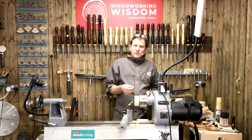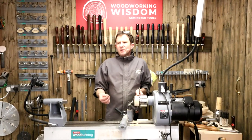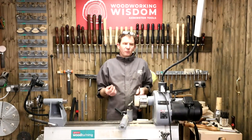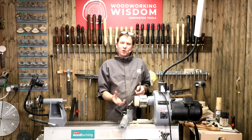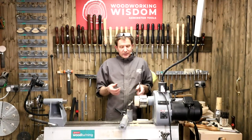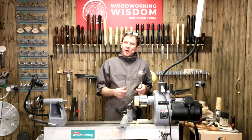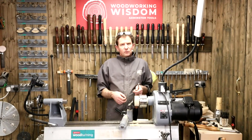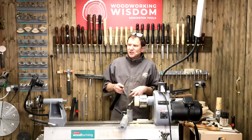Biggest consideration I would say, if you're thinking about that bit, hold it there, give it time to cut. Don't be impatient. Different materials will also play different ways. So the tulip one, I know when we played with last week, it's quite nice. It's something I've got as a bigger size, so you get to see more in here than having something that's 2-inch diameter. If it's too soft a material, it will still cut it, but it's probably likely to go in further quicker. So material density will play a part. Boxwood's going to be different again. We'll cut it nice and cleanly, but I might have to hold it there a bit longer. So all those little considerations need thinking about.